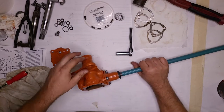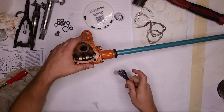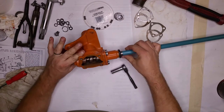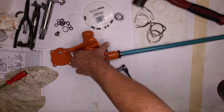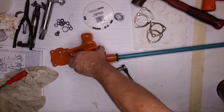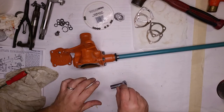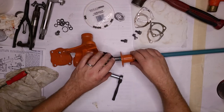There's something I thought about — I actually ordered a seal for it. This opening here is a direct path into the gearbox, and if it rains enough and water gets up on the steering wheel while the tractor is outside, it can seep between the steering wheel and the tube and run down in. There's a little hole in the bottom of the tube but no guarantee it wouldn't be plugged. It looks like I'm going to need more shims because I cannot turn the shaft now. I'll tap the end with a mallet to make sure the bearing is seated fully. Definitely need more shims — I'll try two more.